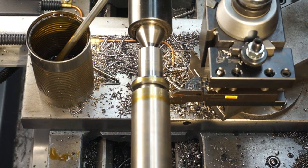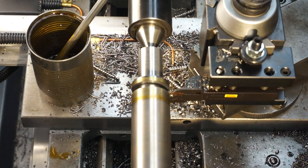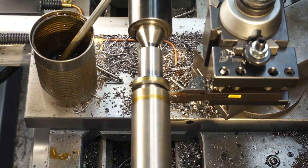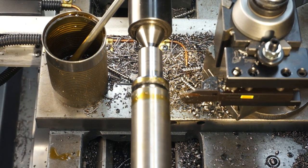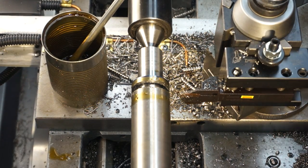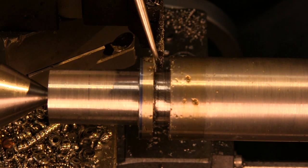I'm going side to side as I'm going because I just want to look at it blending. I'm coming down, I only have 5,000ths left. That's 1,000ths left. All right. I'm going to grab a nice clean pair of needle nose pliers so I can reach those chips in there, or a scribe. A scribe sometimes hooks and lets you break them and get them out of there. Then we'll take a brush and clean that, and get a good look down in there. Okay, I'm going to reach down in there. Yeah, and we can just grab those.